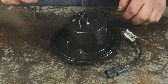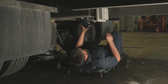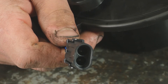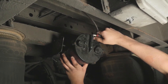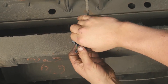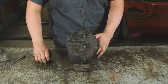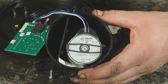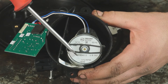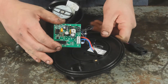For this demonstration, we'll remove and replace both the motor lid assembly and the reservoir. First, disconnect the lubrication lines and remove the bolts from the mounting plate. Next, disconnect the power cord from the lid assembly. The lid assembly is often supplied with a weather pack connector for ease of removal and installation. In this example, there was a continuous electrical connection which was cut, and a weather pack connector will be added during reinstallation of the replacement lid. The motor can be replaced by unscrewing the pump lid and then removing the motor cover underneath the lid. If you prefer, you can replace the complete lid assembly, which includes both the motor and circuit board.